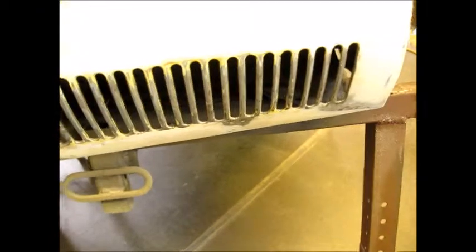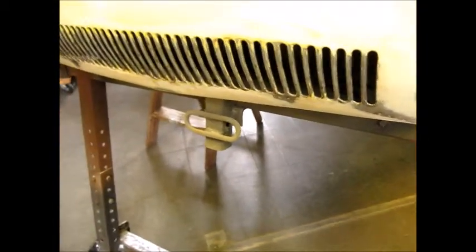And in here I used a couple of different tools. I noticed the paint was just chipping off. You get Bondo in there and everything, so I went to trim the Bondo down, and paint was just flying off because this area was kind of beat up. So I said, alright, let me use a cookie and a file and a few other things and clean those ribs out really good so that I don't have any issues in the future with paint chipping off and it looking horrible. It was probably a lot of overspray on here.